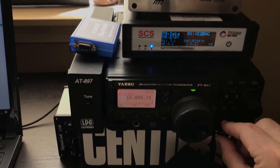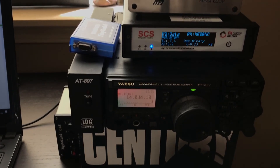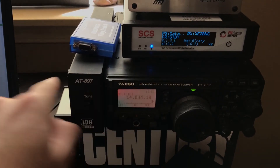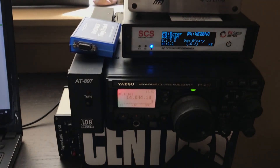The one thing I have a little difficulty understanding is that I do have a GPS connection on the back of this unit, but there isn't any communication method from Winlink to connect to the modem to capture the GPS location. So to post my location I have to disconnect the GPS from the back and connect it to my computer with a serial-to-USB cable. There are other GPS options I could use with a USB cable, but that's not a high priority for me right now.